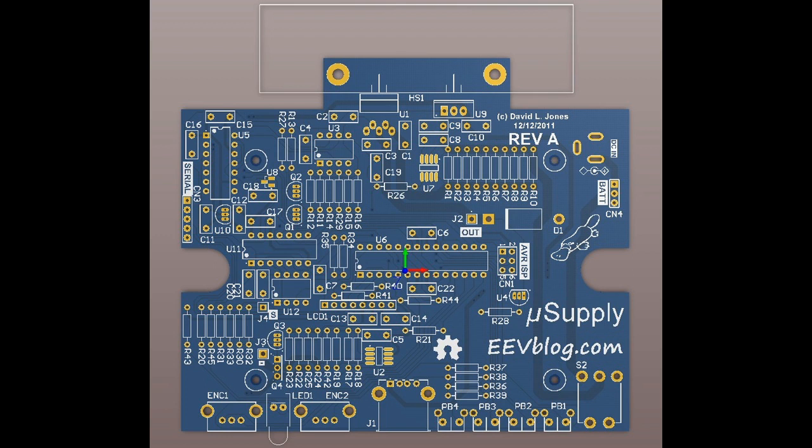I just wanted to mention one of the final passes I didn't speak enough about, which was the drill hole size consolidation. I would have spent maybe 10 or 20 minutes going through the drill hole size table to make sure I know how many drill hole sizes I'm actually using in this design, and to consolidate them, because you might find that some libraries in your component library use an imperial drill size instead of a metric drill size. So it might be 0.795 millimeters instead of 0.8 millimeters that you'll use on other ones or something like that.